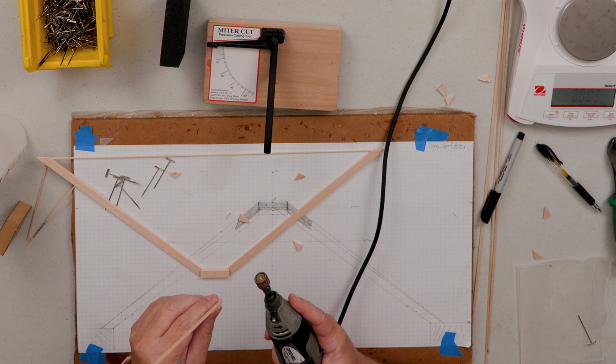So now one handy trick for this tool, you notice it spins clockwise here. So when sanding anything with this, you want to make sure that the sanding wheel is not trying to pop off your piece. So you always want to try and sand it into another piece, like this angle, or if you can't do it that way, you can also do it vertically. But you would not want to use this sanding this way, because it's trying to then pop this piece off.